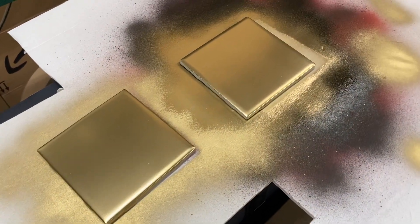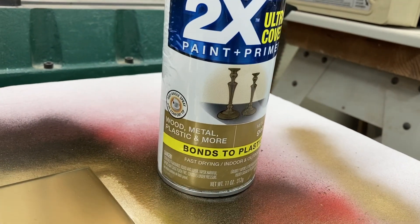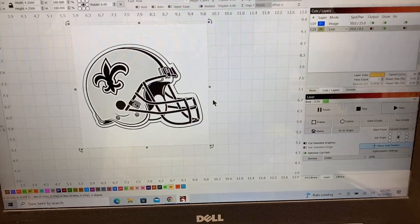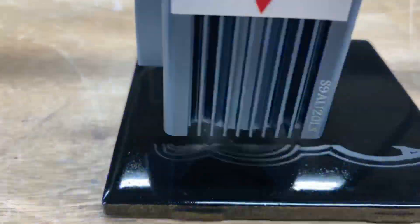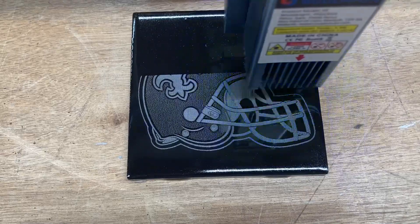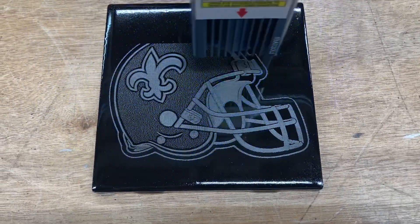Now I'm going to try something totally different. I had some gold paint and I went ahead and sprayed it with the gold color — I think that looks absolutely beautiful. This is a Rust-Oleum gold and it has worked fantastic. The colors are just gorgeous on this, so I'm looking forward to being able to engrave this one. I went to the computer and found a logo from the adult coloring pages — it's time to engrave this, and it is the gold with the black. It's the exact same process and I'm using this at 50 inches per minute with 25% power, because that has worked really well for each of the different colors. So I did not run a test grid specifically for the gold because the process of painting is exactly the same — once you have that done, it is going to be the same each time. The 50 inches per minute with this painted tile and the results are awesome.